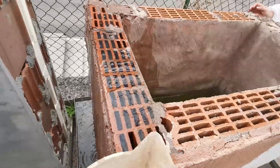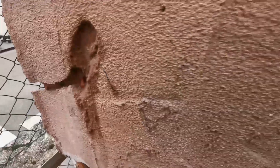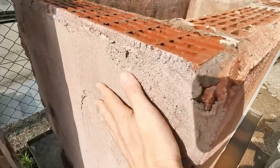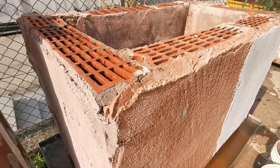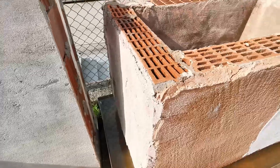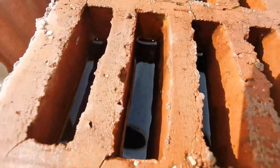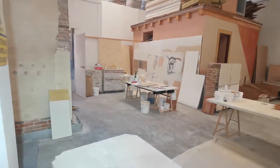This water from the wall can only escape by evaporation, the wall structure being lined with the waterproofing Rinzaffo MGM base coat both internally and externally. Coming back half an hour later, we can see that the plaster surface is dry overall, except in areas where the waterproofing coat is damaged — here we have a water leak. I asked specifically about these cracks and was told they developed during transportation when the wall structure was moved around. Coming back the next day to inspect the same wall again, the plaster surface is completely dry despite heavy rain that occurred overnight. The Rinzaffo MGM plaster, being breathable, evaporates out its moisture content, keeping itself dry. Due to ongoing evaporation, the water level inside the brick is now lower than yesterday, when the wall had been filled to the brim.